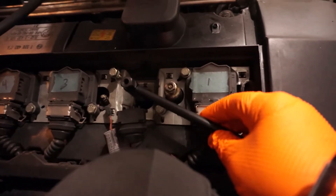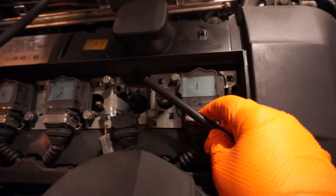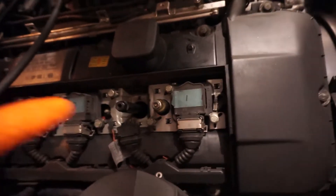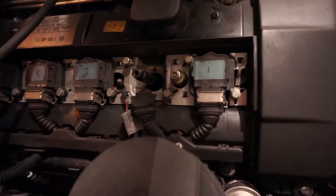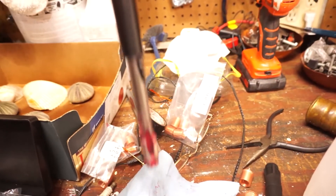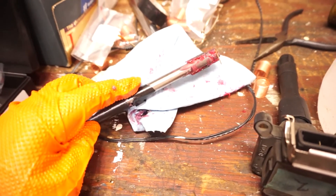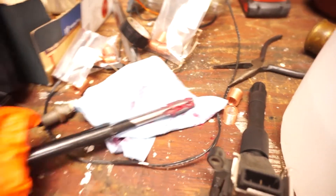We'll use the provided tool here to turn it, but it looks like it's going to be interfering with these bolts, so I'll switch to a ratchet. We'll just thread it in a couple of turns at a time, back it out to break the chips up, thread it back in, back it out, take the tap out, clean it off, and just do that until we're completely through. Quick tip: I had a problem with the tooling falling out of the holder, so I took a single piece of electrical tape and put it right across the end then shoved it inside the holder — now it doesn't fall out, which makes it much easier.